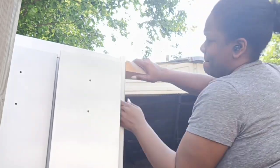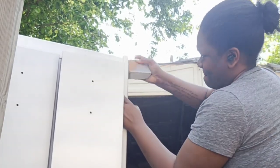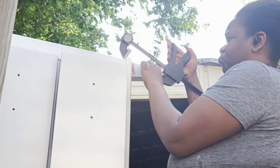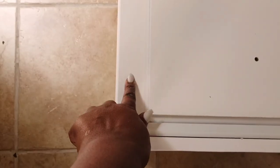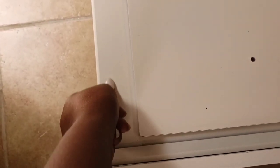After I got all my glue in place and my wooden skewer down in the hole, I just screwed this back in place and then, after a little bit of a struggle, I was able to put my clamp on and clamp it in place. Since I forgot to scuff sand before priming, I just wanted to do my due diligence to make sure I could still achieve a sound paint job. You see me scratching hard enough that it's actually putting little dents in the wood, but it is not removing any primer, so I'm confident the primer will be okay even though I did not scuff sand. I will not skip scuff sanding in the future, but for this instance I felt like I tested it thoroughly and it was going to be okay to proceed. Thank God, because this dresser was too heavy to drag back outside.